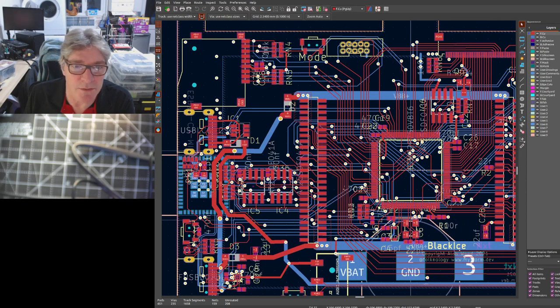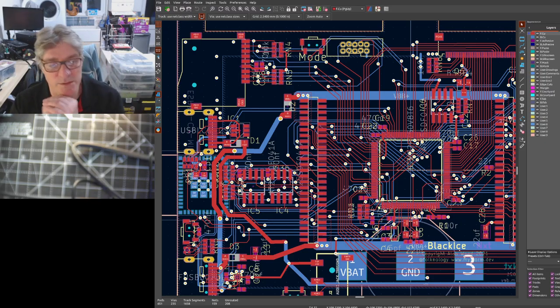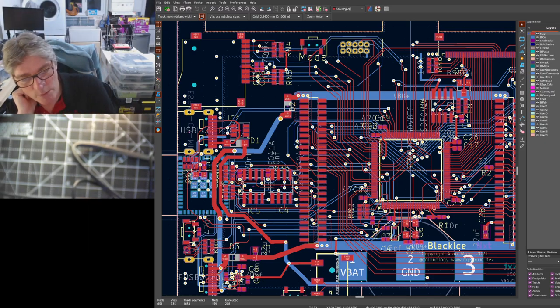It also has extra pins left over, 6 of them, because we've gone down from Hyperbus to QuadSPI for the memory. That means we can get a QSPI connection into the FPGA itself from the ESP32 as well. So we get the best of both worlds. How we're going to use that depends. We can already use the SPI in a normal transfer mode.